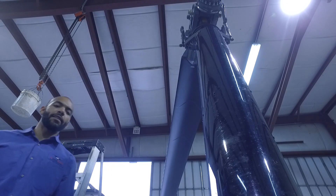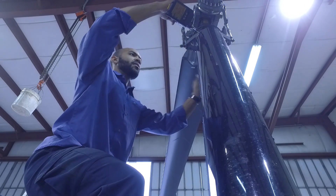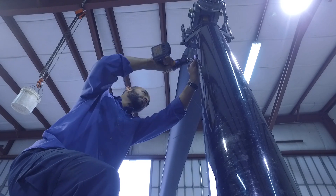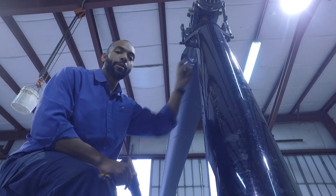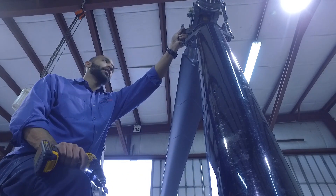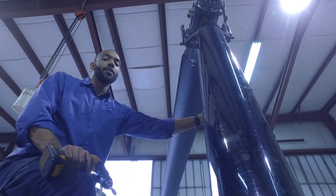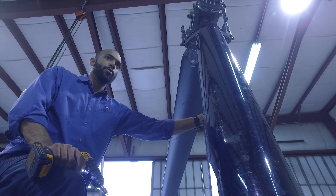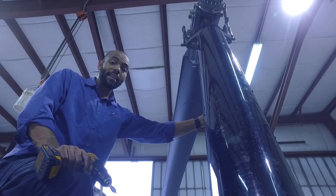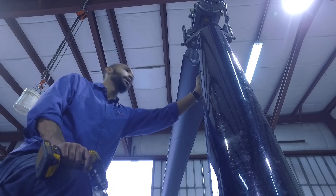It's a little inconvenient to time lapse here, so I'm just going to go ahead and get started. Always have a backup plan when working up here too. If I get unstable, maybe I'll grab the pitch link, maybe I'll grab here. I wouldn't grab onto this strut fairing — it's not super duper sturdy. Your feet are spread apart on different surfaces, so just have a backup plan. That's a good tip.